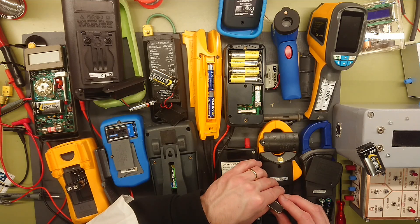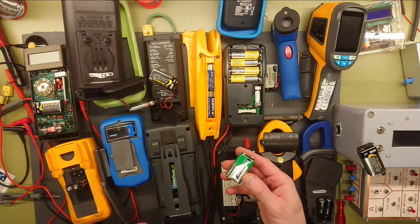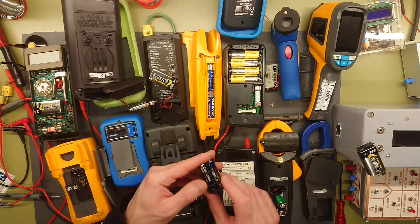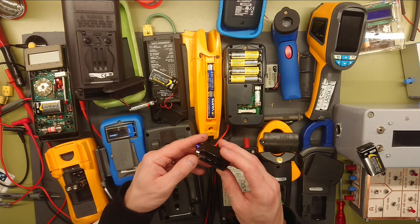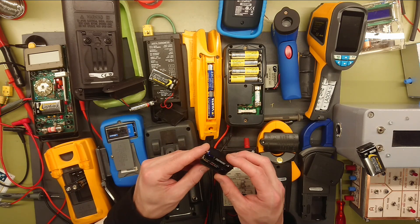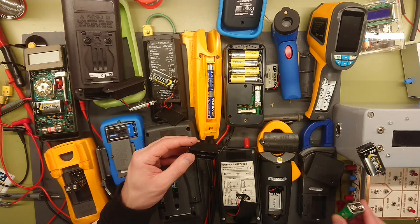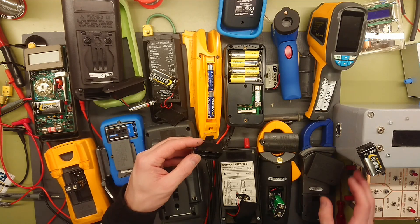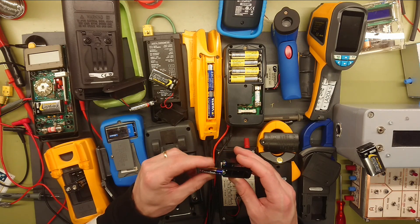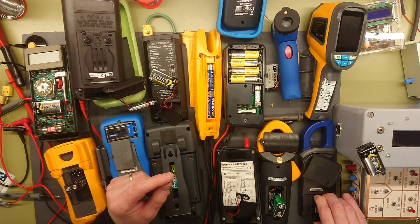The clamp-on meter's built-in battery is stamped 2014, but luckily no signs of crystallization — so even though it's six years overdue, it is still in good shape, but it's getting changed nonetheless. The 400-amp clamp-on meter has an interesting battery case for AAA batteries, which I haven't seen before — makes it pretty easy to change out. Interestingly, a 9-volt battery would actually fit into that slot, but as it's only made for 3-volt operation that would probably damage it. There are no date stamps on these, but it's a fairly new meter — two or three years old — so I'm not going to change those as they look fine.